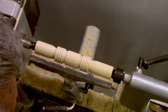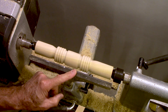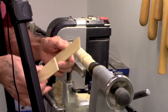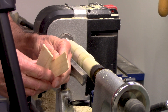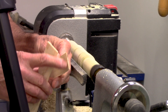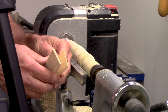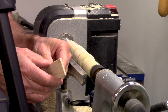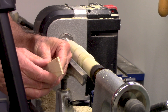I'm planning on adding a little bit of decoration between each one of these mini beads — a burn mark — and I'm going to use a standard shim shingle. As it comes out of the package, the shim has a fairly narrow little edge to it and that'll fit pretty well between each one of those little beads. If I'm doing a broader area, all I need to use is a razor knife to cut back the edge of that shim, which will give me a slightly broader burn.